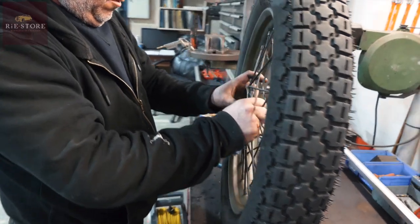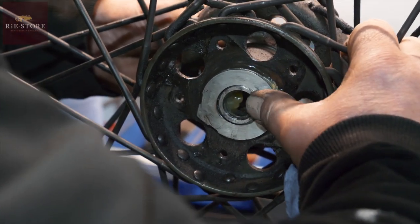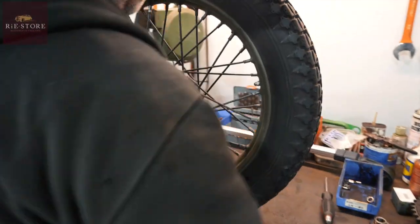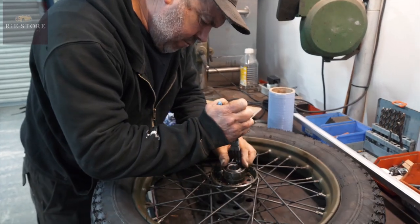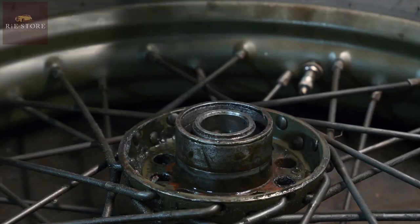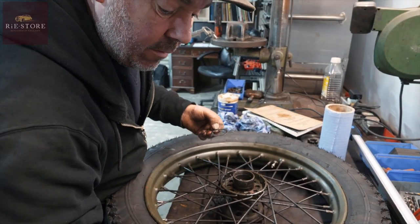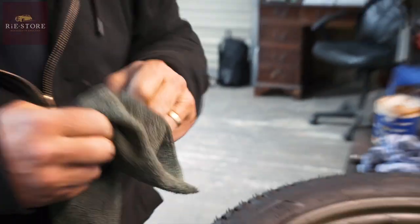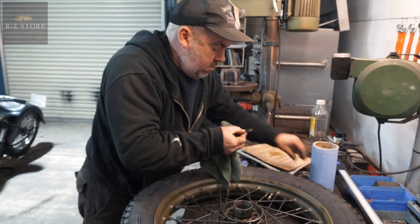That can only hit the hub and you've got that much play there — so that tab washer that went in there is too small. You'll never ever get rid of that, it's impossible. You need it there and then shim that up. So the base washer underneath the large bearing is wrong, which is a pain in the ass, but we've got to make one. That washer in there should be underneath this — basically that washer goes underneath that, on top of the oil seal to compress it more. I would imagine it's probably the same thickness as the base on the other side.